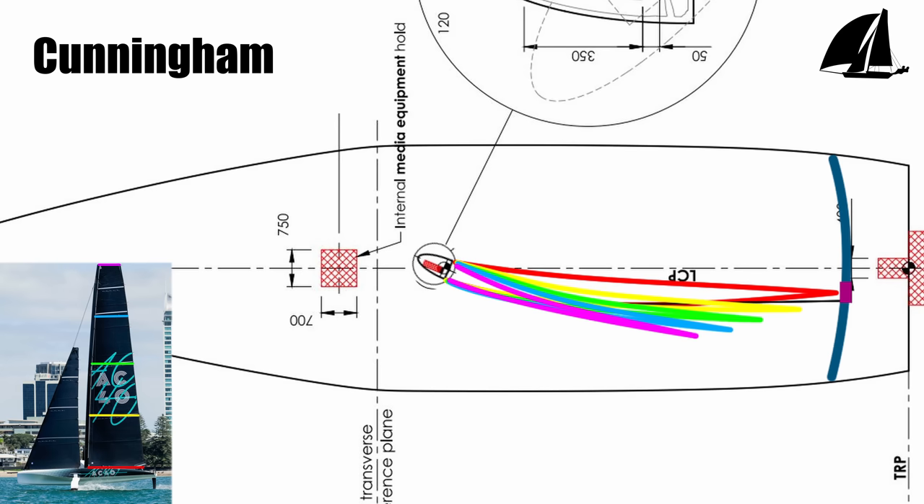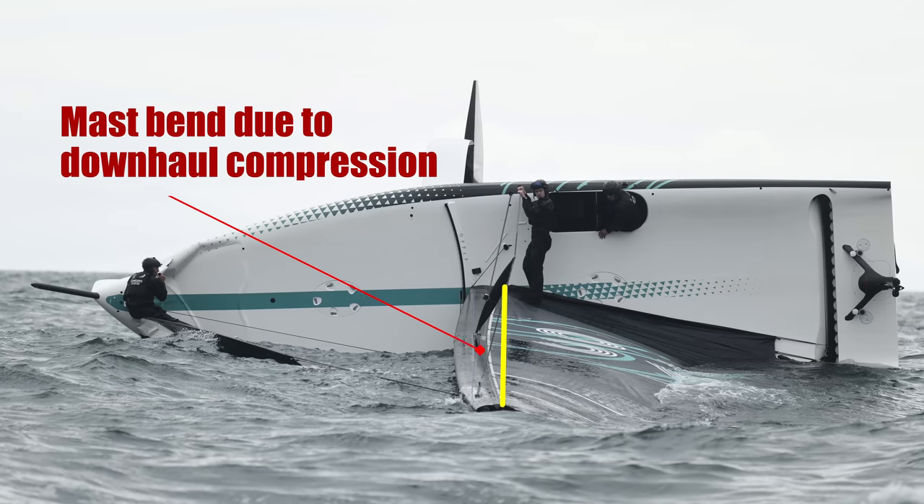If moving the incredibly loaded mainsheet was hard enough, doing the mainsheet and outhaul simultaneously when a gust hits is even harder. The final control is the Cunningham, and on paper this control is perfect. The increased use of Cunningham in the previous cup was one of the big leaps that INEOS made from the World Series to the Prada Cup. So why not just trim the main solely with Cunningham to twist the sail? Well, the Cunningham works by bending and compressing the substantial D-section mast, which takes huge loads — up to 8 tonnes. Add the friction of the sail in the mast track and it's a hugely energy-sapping endeavour to pull on Cunningham.